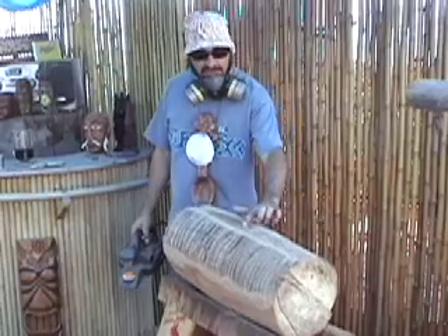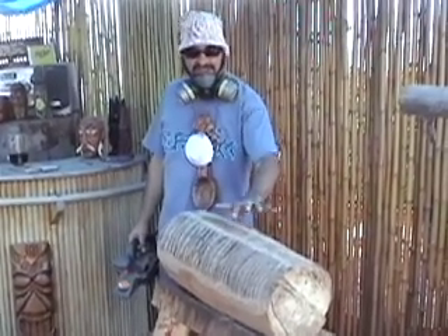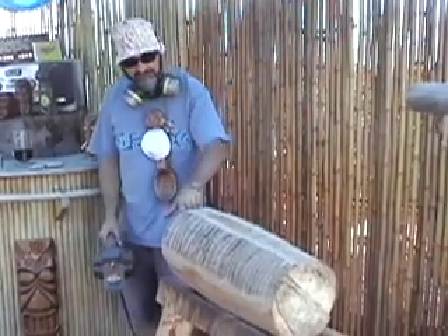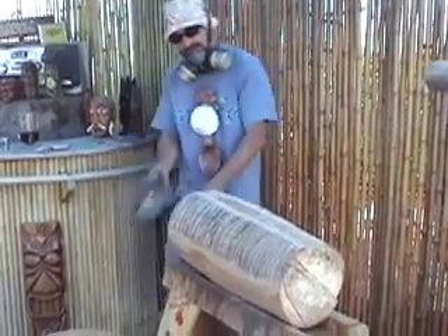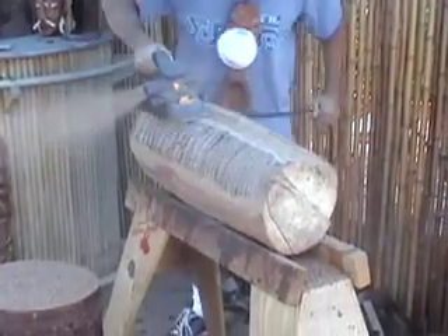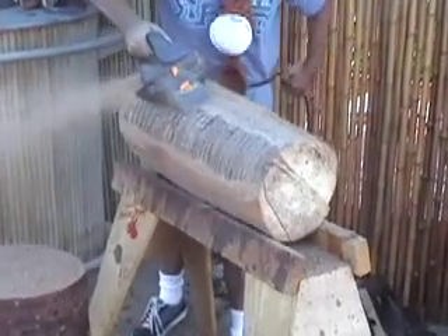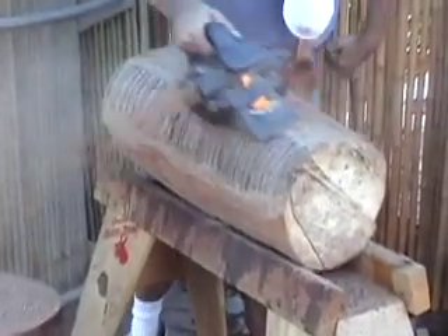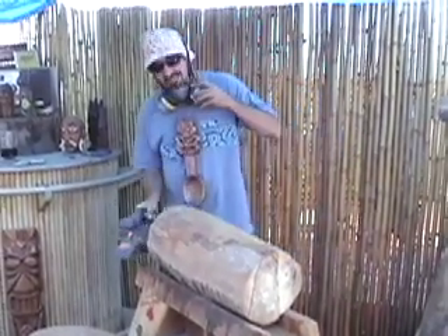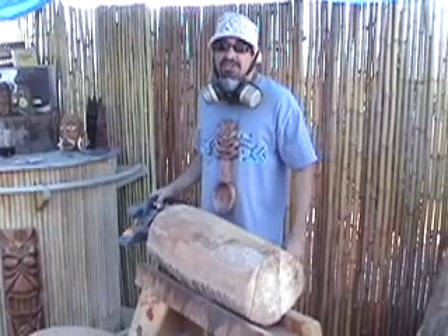You notice I stopped right when I started hitting the carving wood. This is the bark, this is the wood — it just changes a different color and it changes the density. This will be holding a lot of good detail. You notice I've got a flat plane here. Now what I do is just work these two corners here and bring those down and the whole thing will be round. That looks good. After a word from our sponsors, I'm going to show you how to do a big log.